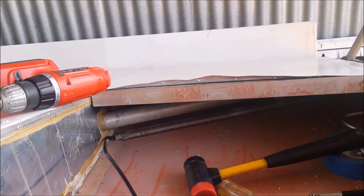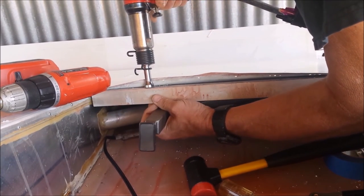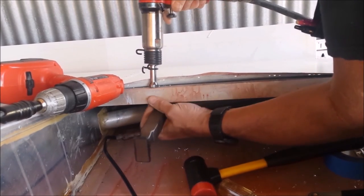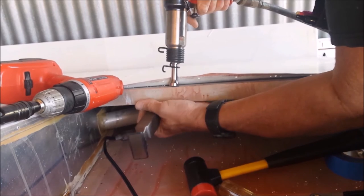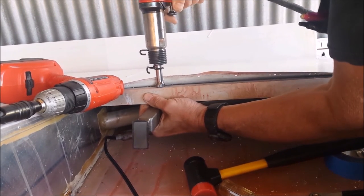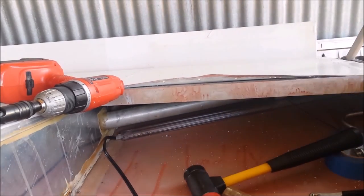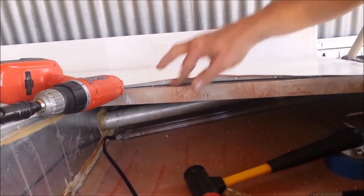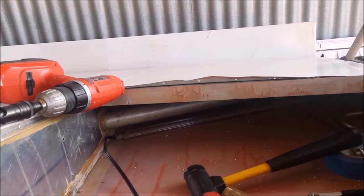Oops, that's a drill. Doesn't help that I haven't driven a rivet in anger since the 1970s. Okay, that should be good. Good on the bright side. All those rivets have to do is hold the nut plate from falling out when I put the screws in. It's the screw that does the work, so it's not quite as critical as a structural repair somewhere.